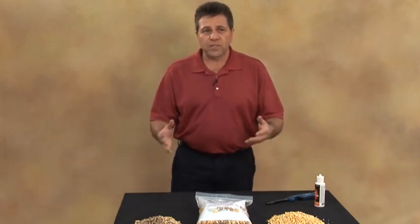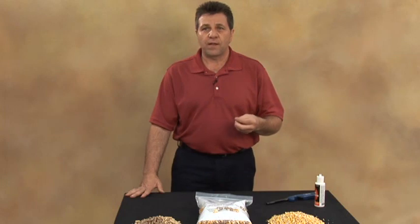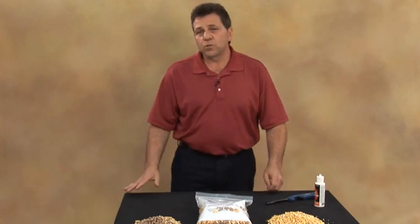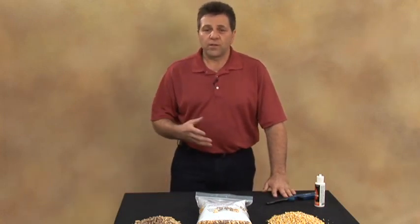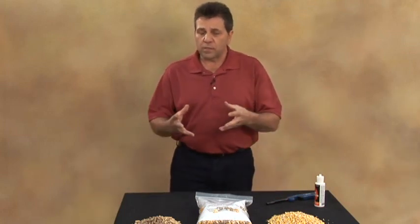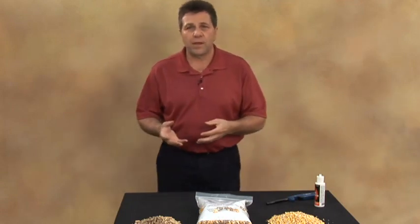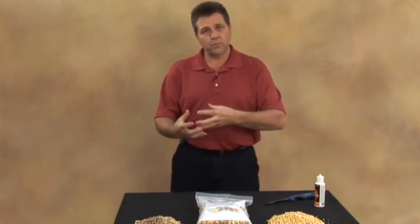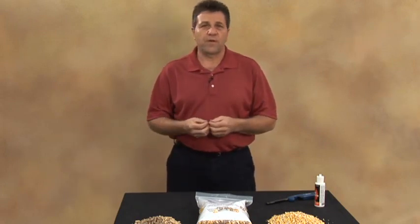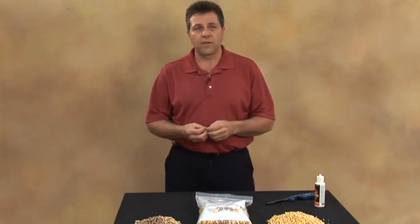If you're deciding to use wood pellets as your primary source, you're going to want to make sure that you find a good supplier of premium grade wood pellets. A couple words of caution: make sure that you do not buy wood pellets that have been left over for the season and are a year old, because the pellets will take on moisture and could start to crumble. A good indicator of this is when you open up the pellet bag, check to see how many fines and clumps of fuel might be inside the bag. If you see an excessive amount of fines, or if you see clumps of fuel, don't buy that fuel. You'll have nothing but trouble with that in your appliance.